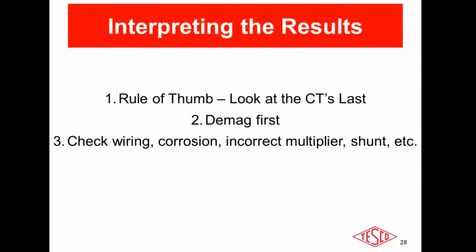However, by doing CT testing in the field, you will find all these other issues, the bad wiring, corrosion, etc., which all lead to less revenue for your utility. And because of the nature of the application of CTs, you only use them for your high bill customers. It only takes finding one or two bad installations, not necessarily a bad CT, but something wrong with an installation, and there's your return on investment for the equipment and doing the CT testing.